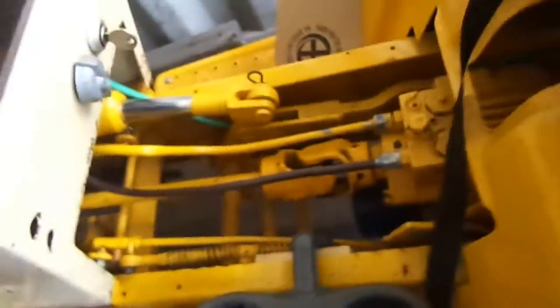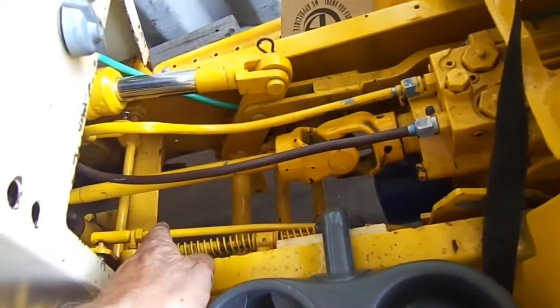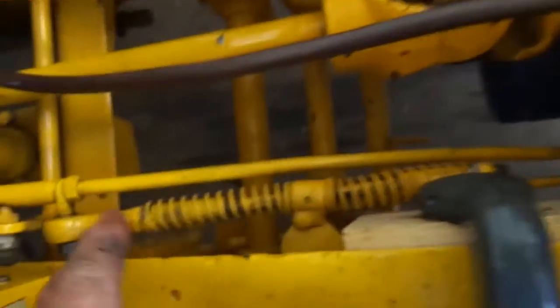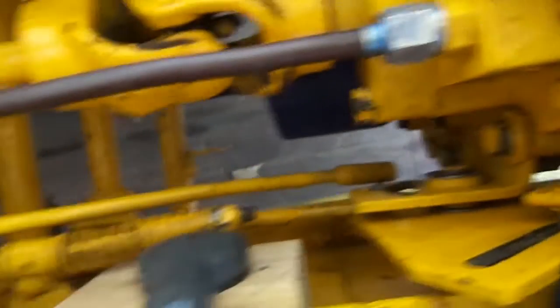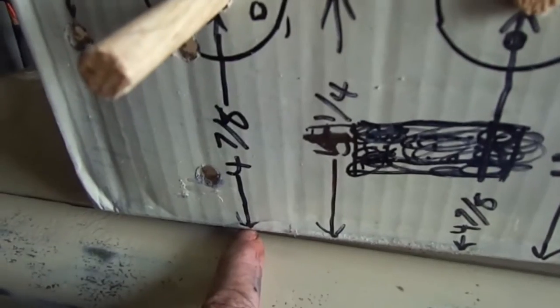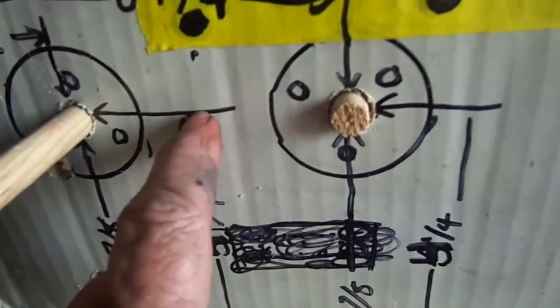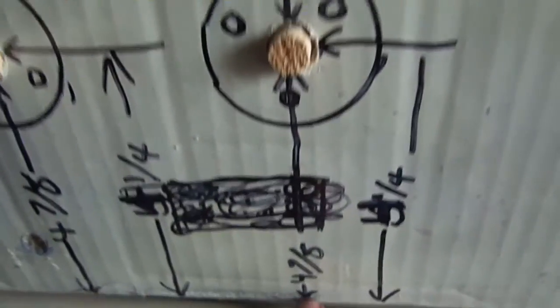You can see that ratio here when you do the pedal. This gets faster — when you push that pedal, this rod outruns the pedal. Anyway, this one goes back here to your hydrostat. That's the one that's got my spring — it goes to the hydrostat on the bottom down there. There's my neutral spring. The height from the bottom of the frame up to the center of this thing is four and seven-eighths inches. That's the center line — four and seven-eighths. Same way, four and seven-eighths.